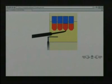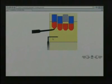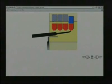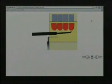Now remember, these are loose. Now this one, that was the one that was binding. And you'll feel that. You'll say, oh, that's kind of sticky. You go up, up, up, and it clicked because I set that. And you keep trying pins. These are loose. These are loose. Okay, these aren't binding. You say, oh, now this one, I felt it a little more. I felt it click again. And one at a time, click, click, click. Eventually, you'll just get those pins all set up. And once you've got the last one, lock pops open. It's not that difficult. And to put my foot in my mouth, we'll see how not difficult it is with a demonstration.